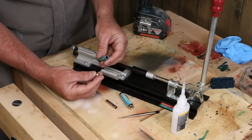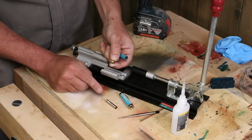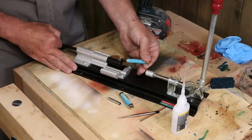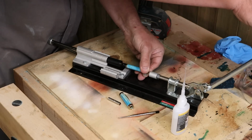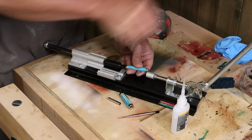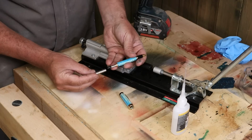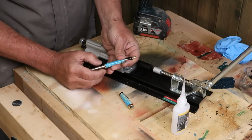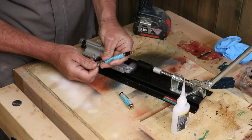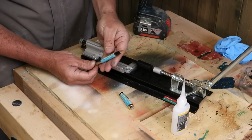again, we just need to add under pressure this little capture ring here. Now this has a resistance fit here, but it has a thread on this side, which in turn the mechanism then threads into. So we're just going to push that in. So we'll do the same thing. We'll put that into that little hole that there is there. That should be enough length, and then we push in. It's good. Then your refill goes in and your mechanism threads on to that area there, and then you can see just by moving that mechanism, the nib is coming out and then retracting back in again. Alright, so a nice little mechanism.